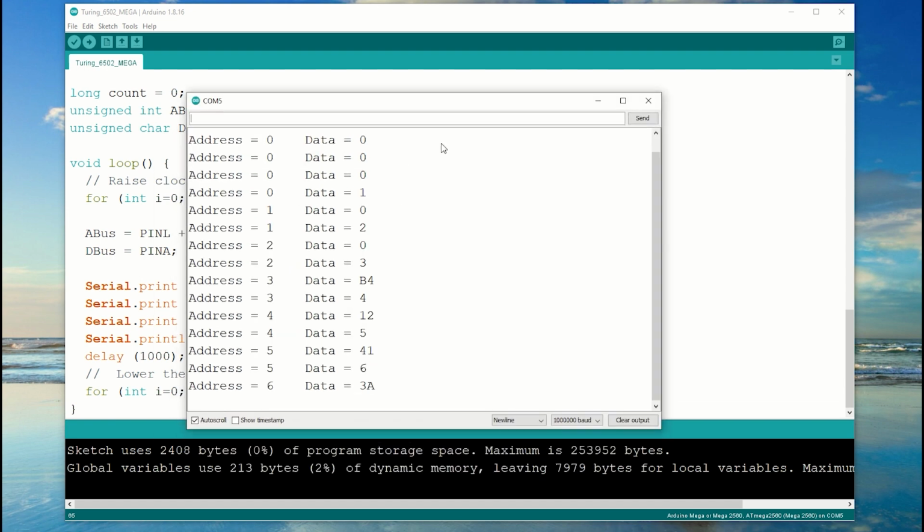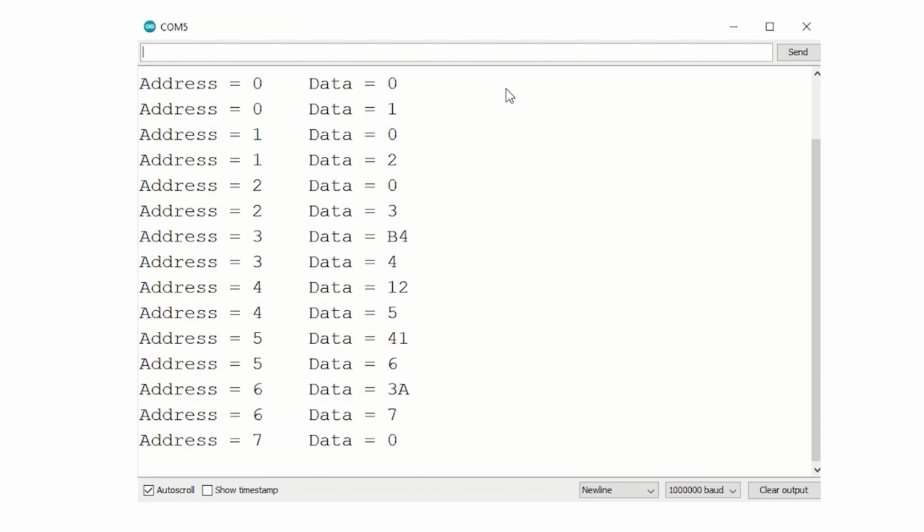That looks better. So this initiation sequence after reset looks different to the normal 6502. For a start, the addresses appear to be occurring in pairs. Then I can see that the second piece of data ends up being the address on the next line.